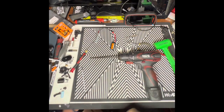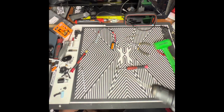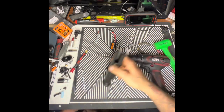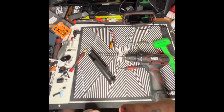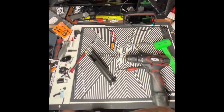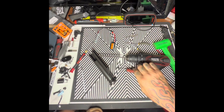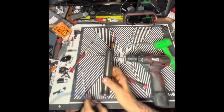Okay. My buffer tube ain't wanting to line up, and y'all want to know why? Because my spring guide got twisted a little bit, apparently. And I probably could have just went ahead and sent it on home, but I'd rather look at it. No, spring guide's perfect. Jajar, what are you doing here, boy?